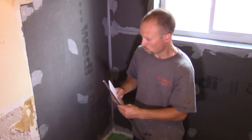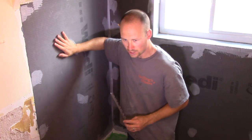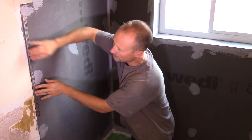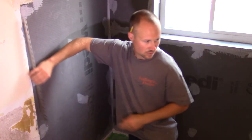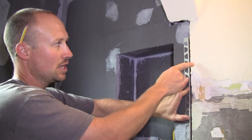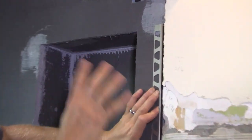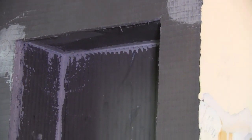When you have walls that stick out further than your new tile wall, that changes the look. If you put this one up to this wall, it actually works perfect — this is almost the same. But on the other side, the 5/16 metal edge pretty much disappears. So that side would show up nicely, but on this side there would be nothing. In that case, I would jump to at least a three-eighths edging.